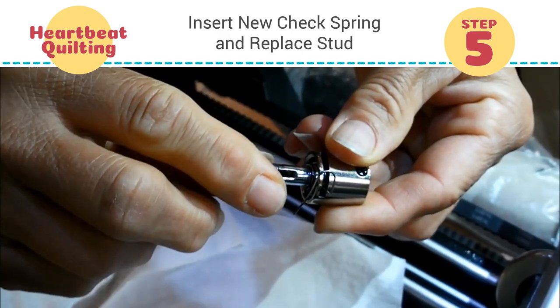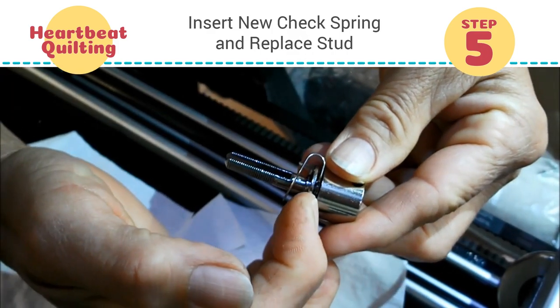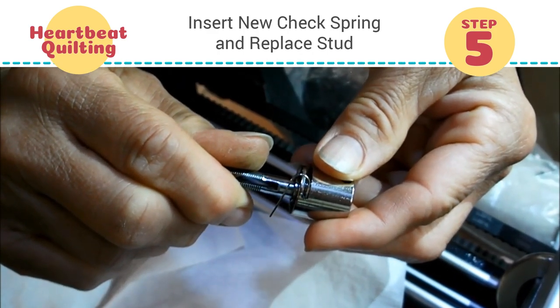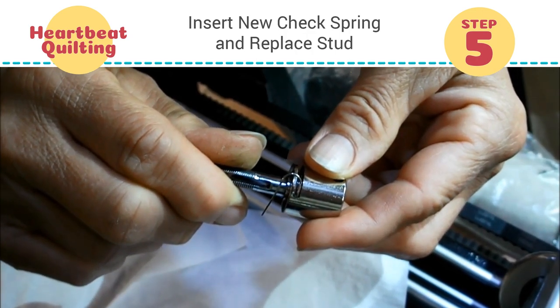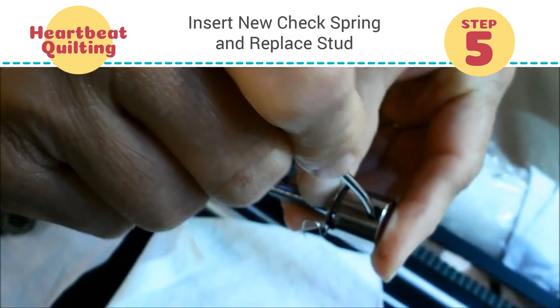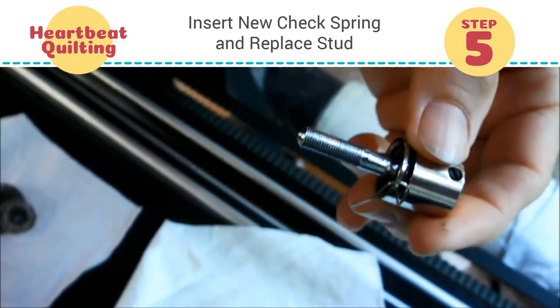See how I can move it. So then we turn the check spring until it touches the end of that slot, and now we're going to rotate it another one-eighth of a turn, or 45 degrees. You can look at this empty slot here, and that will help you determine how far to turn it. And now we're going to tighten the screw here.